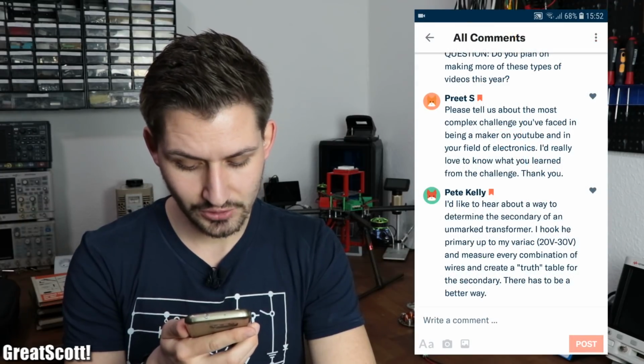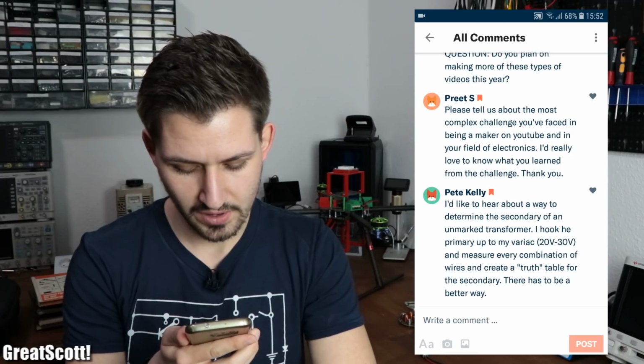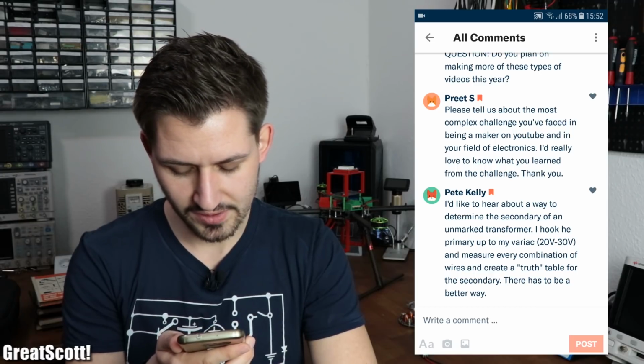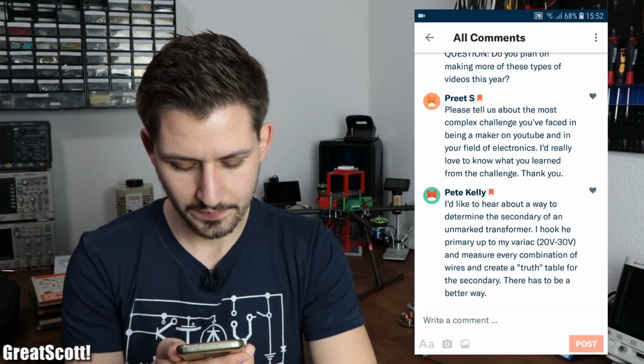Last question from Pete Kelly. I'd like to hear about a way to determine the secondary of an unmarked transformer. I hook the primary up to my variac, 20 volts to 30 volts, and measure every combination of wires and create a truth table for the secondary. There has to be a better way. Is there a better way? Because I'm doing it in a similar way.